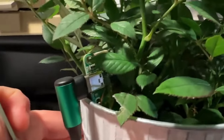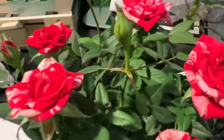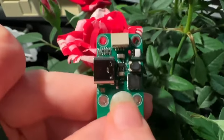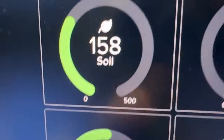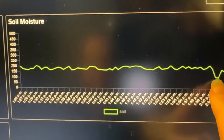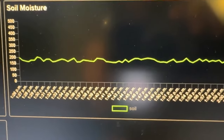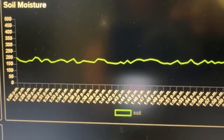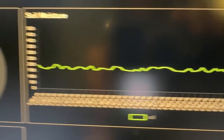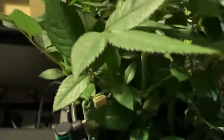Here it is in this lovely flower pot from Trader Joe's. I'm measuring soil moisture using the capacitive sensor — you can see the two pads — as well as temperature, humidity, and light, and uploading the data to Adafruit IO. You can see where I pulled out the soil sensor briefly to re-seat it. I'll plot this over a couple of days — that number should dip from 200 down to zero as the soil gets drier and less capacitive. Then I'll set up an Adafruit IO alert to let me know to water the plant. A little all-in-one plant monitoring system, so hopefully I won't kill plants as often.